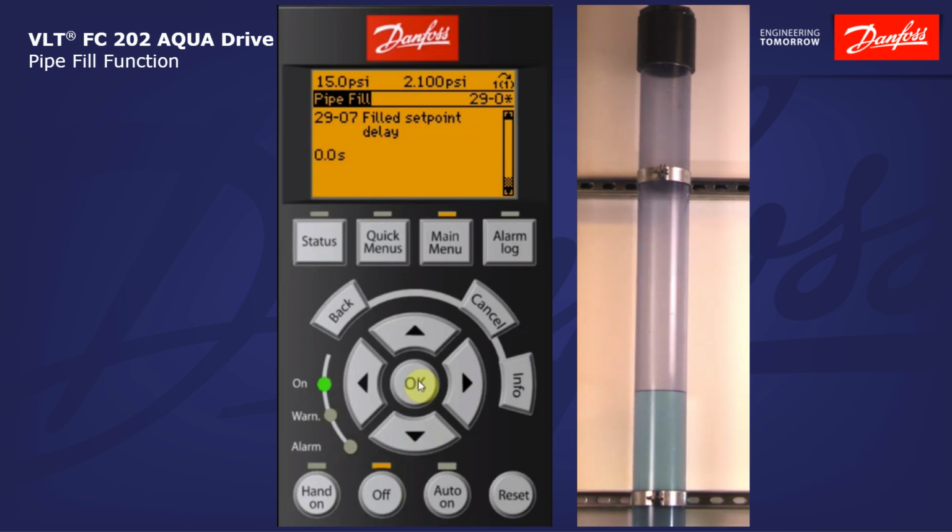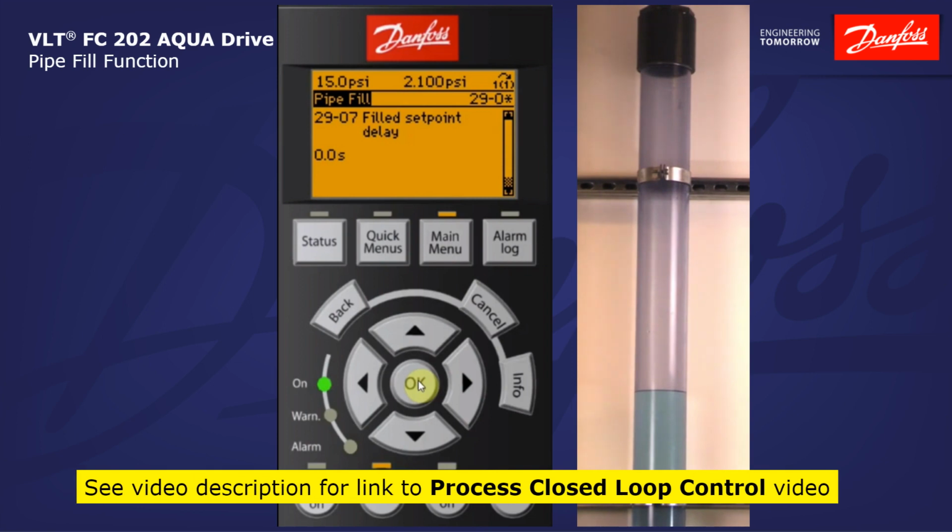I should point out, for the pipe fill to work, you must first have the drive set up in process closed loop control with transducer feedback. Obviously, without that, we can't read the actual system pressure. If you're unfamiliar on how to set that up, you can refer to my YouTube video on that subject.